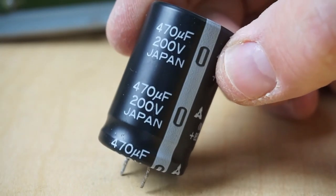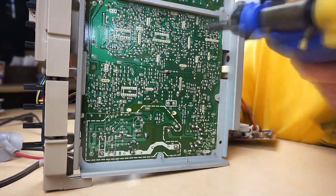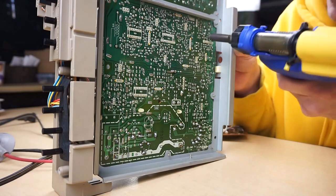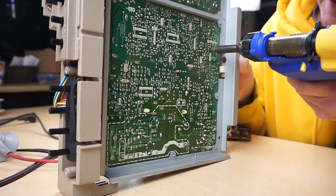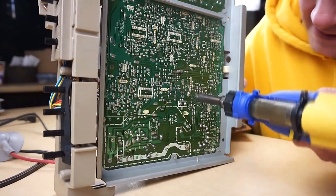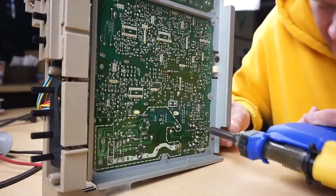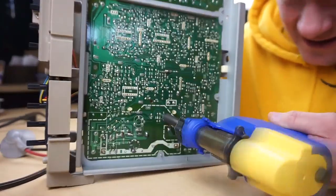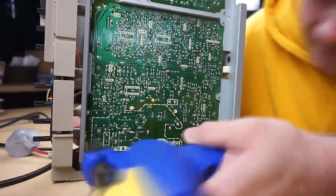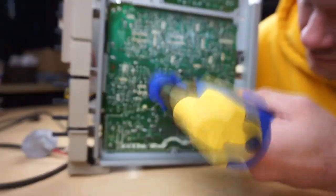And as this recap job continues, I will talk to you a little bit more in detail about our replacement capacitors that we will be using today. Now, primarily in my business, we use Mouser.com to order replacement electrolytic capacitors. There are many other suppliers that might be better for your region or that you may have a relationship with. That's perfectly fine as long as they provide correct values for voltage and microfarads. Do pay attention though, because sometimes these older chassis do contain 1 or 2 bipolar capacitors, which you can request in your order sheet or when you're hunting for capacitors at your supplier's website. Please note that you might need to check that you get 1 or 2 bipolar capacitors. Again, pay very close attention to your chassis to see if there's any of those noted.